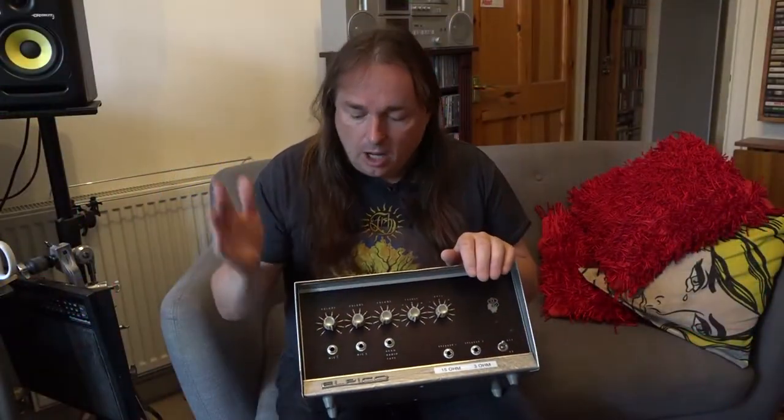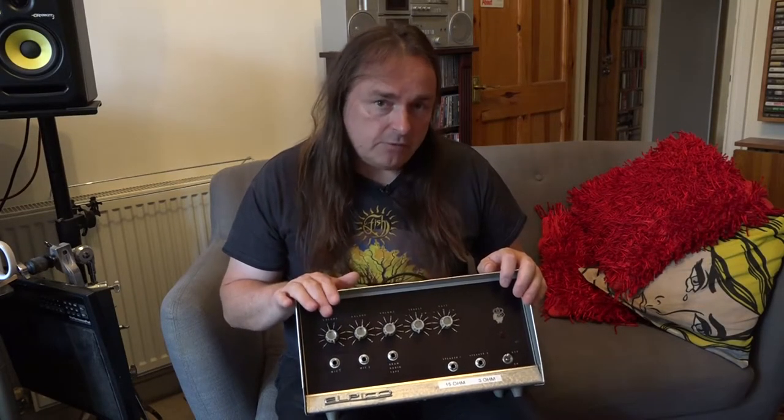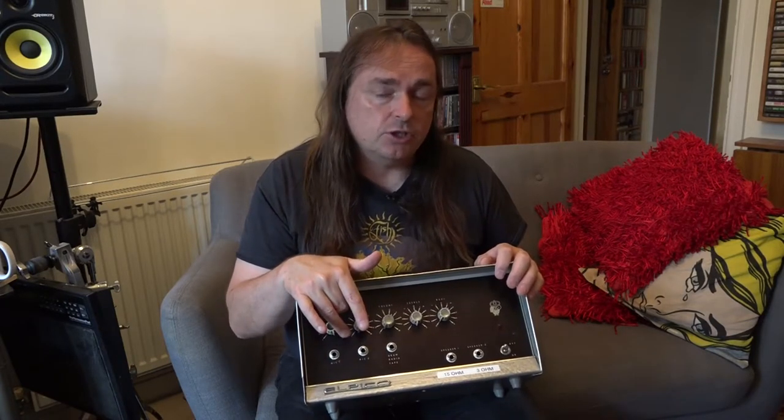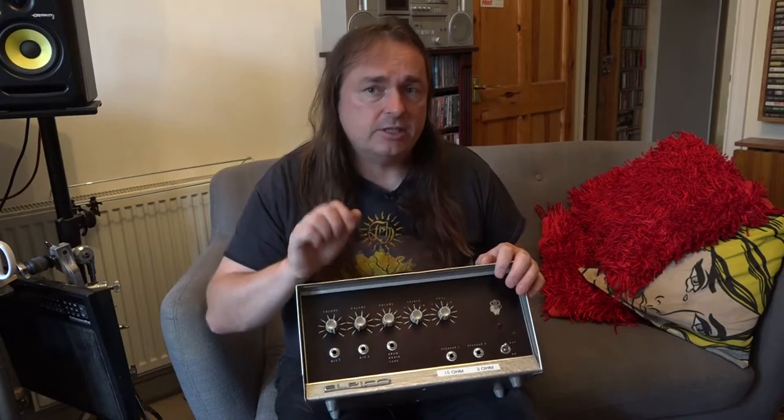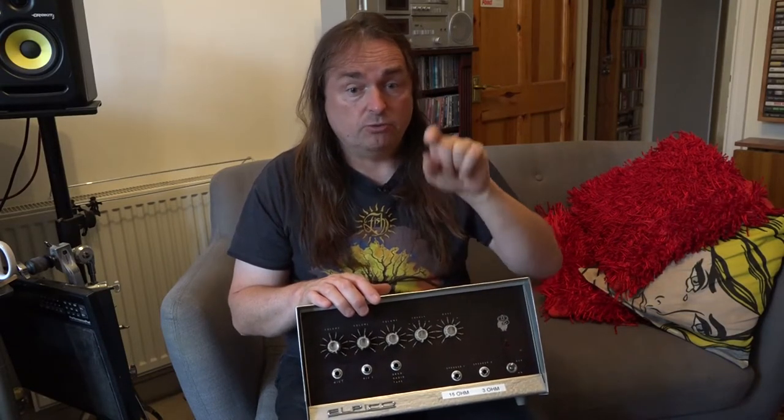I hope you like this video. I'm a massive fan of this amp and you can still find these on eBay, though the price is creeping up and you don't see as many of the early versions as you do of the later version. The later version has already been badged up as the Sound City Studio 20 - it's effectively the same amp, although the schematic doesn't quite tally up with what was actually inside here, though I used the Sound City schematic when working out component changes. They of course have a printed circuit board inside - it's swings and roundabouts. I prefer point-to-point wiring, but a printed circuit board is much easier for changing components because you literally just desolder a component and put another one in.